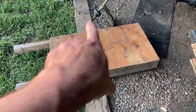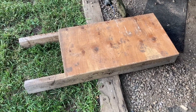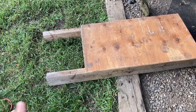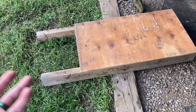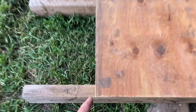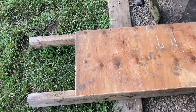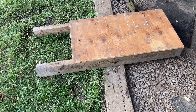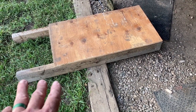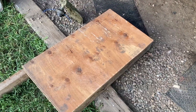I have my base cut at 19 inches wide by 35 inches long, and I have these rough-cut two by fours — regular two by fours would work too. I'm just making a base because they seem to have bases, so fine, whatever. I'll mark these, cut them to length using a compound miter saw, attach the top to the two by fours, and run pieces along each side so everything is nice and flush.